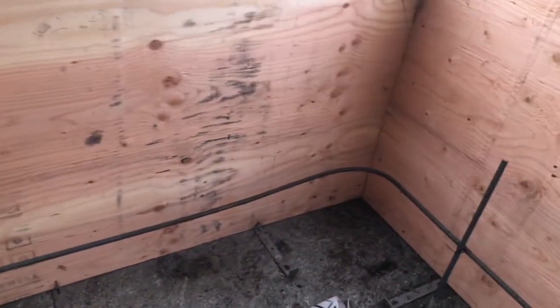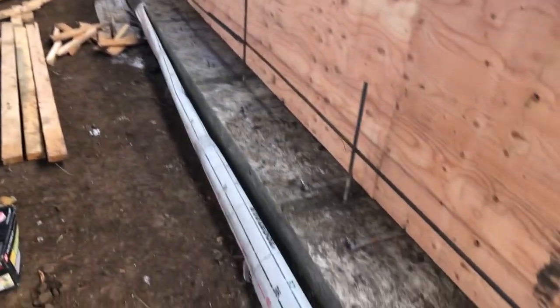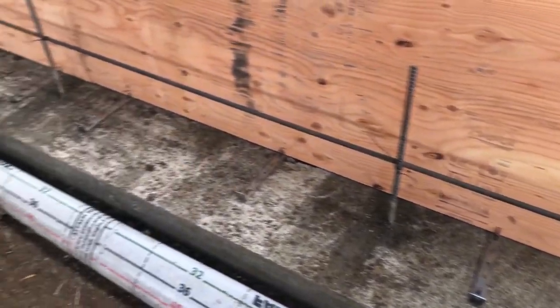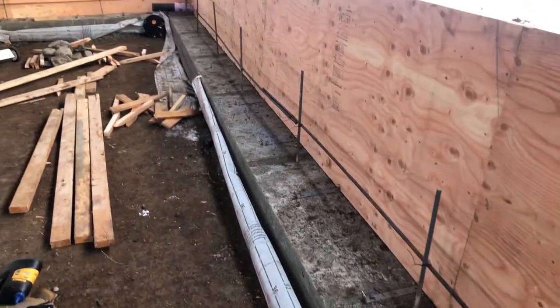We've got here, so this was the corner where I was testing every so often. If you've poured concrete in cold weather before, or if you have a little bit of building experience, you'll know that your concrete can't freeze. And a common thing that's done to help the concrete cure faster and get past that delicate freezing point is an accelerator. So Monday morning came, it was time for our pour. We were scheduled to pour at 9, and I had a bunch of people up here to help with the pour, and 10 after 9 rolls around, no concrete truck.